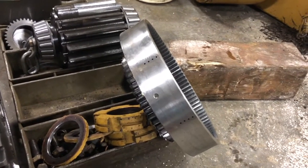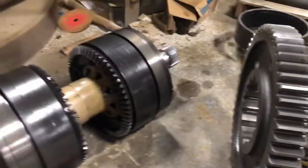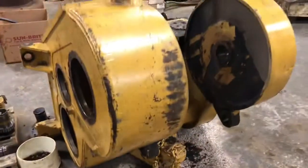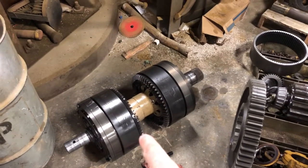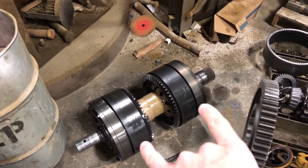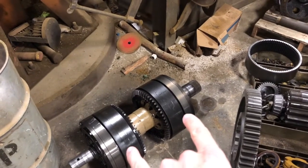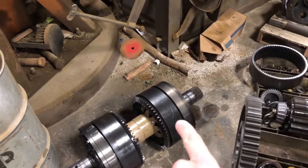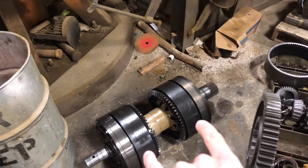That's where all the energy from the tractor PTO — the entire horsepower that goes through the PTO — goes through that input clutch. When it's not engaged, no power goes to the drum, no power goes to the winch. When you want power, the valve engages that input clutch, locks it up, and then the winch engages the forward or reverse clutch pack. When the winch is in neutral, these clutches are both locked up and that becomes your brake. It's unique — a design only used in Cat.